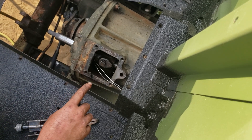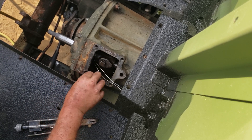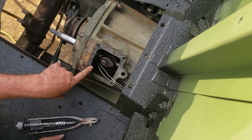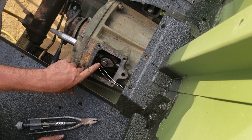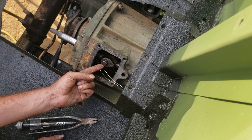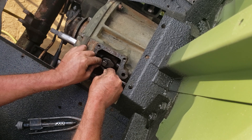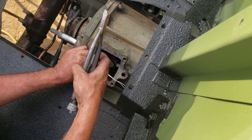Here's the thing: when you're attaching to a fastener, you need to visualize the way the fastener turns when it's tightening. It turns clockwise in this case — there are left-hand fasteners, so bear in mind you always want to come in and go to the side. Keep in mind you're trying to tie off the side that would be spinning away first. So if it were to back off this way, this side would be going that way first, so you want to attach to this side first.